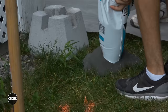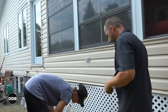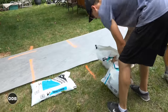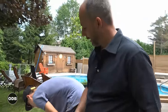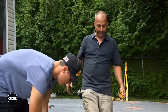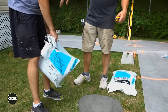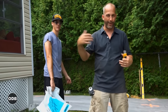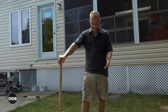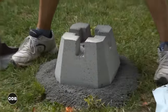Limestone screening is just a leveling process. We're going to put about half a bag down for each one of these blocks, use the tamper and a little bit of water, and set our block on top. That'll just level off the surface. Because we're using box beam construction, we have the ability to cantilever the full extent of the deck past the point load on the post. This is really effective — it gives you a lot of mercy when you're building. You don't have to measure things out to the millimeter; you can be within a couple of inches of your target. Really all we need is the center line of this deck and everything will overhang our box beams on each side.